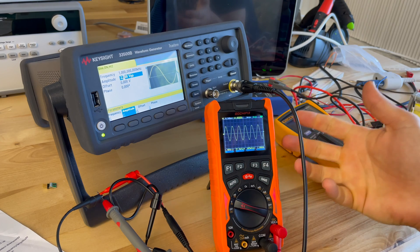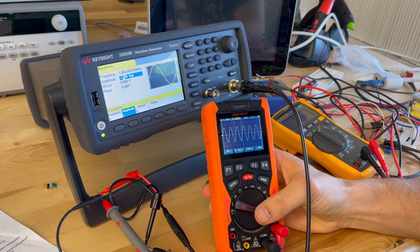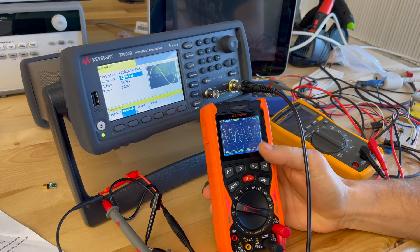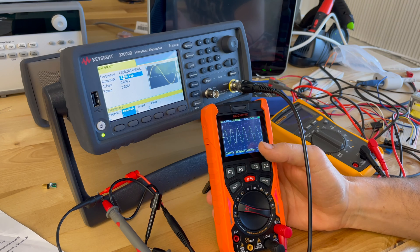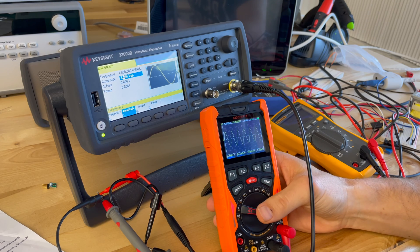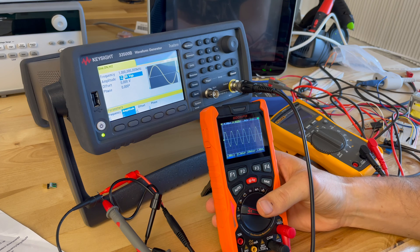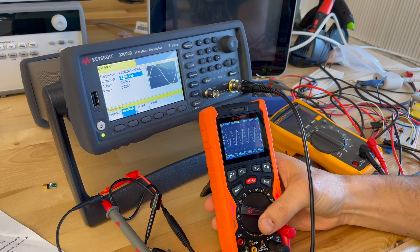It's a pretty neat little tool to have. I've seen a lot of those portable USB-type oscilloscopes you can get, and I'm not too big a fan of those, but adding that functionality to a little portable handheld multimeter is kind of cool and clever. Like I said, it's not going to be great for all applications — if you're measuring small signals or really high-frequency signals, this is not going to do the job. But for a lot of simple things, like peak detection, sensors sending out signals, or troubleshooting your microcontroller, as long as you're dealing with higher-voltage, lower-frequency signals, you'll be fine.